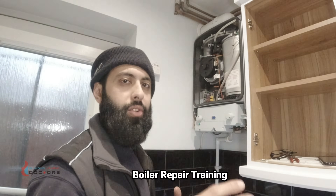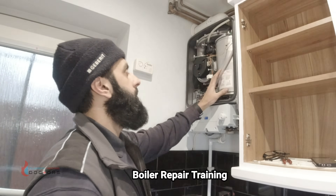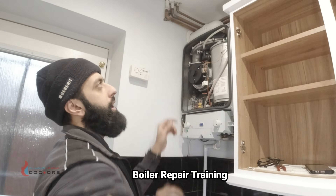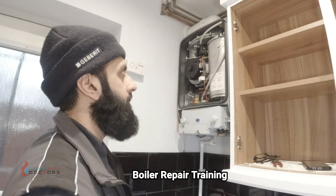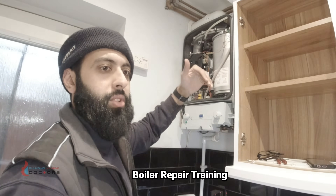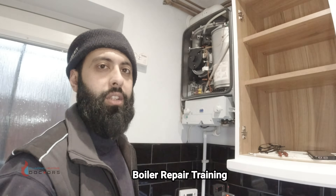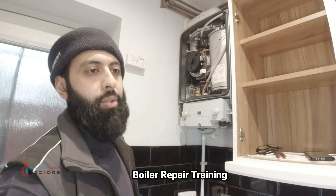While I'm here I'm going to check the safety stuff. There was a technical bulletin released on these Worcester boilers telling engineers to check the combustion seal — the burner gasket at the top. You get your flue gas analyser, put the probes around the top, and check for any CO readings or ratio readings. If you get a reading you need to take it off, change the electrodes, and change that seal. If the customer won't allow the repair you must issue an 'at risk' notification and leave — or carry out the repair.